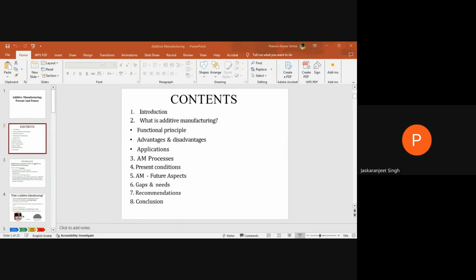If we talk about advantages of powder bed fusion, it produces strong and functional parts with good mechanical properties, ideal for batch production of complex geometry and interlocking parts. Applications of powder bed fusion are in medical implants, automotive parts, and aerospace applications due to strength and material flexibility.